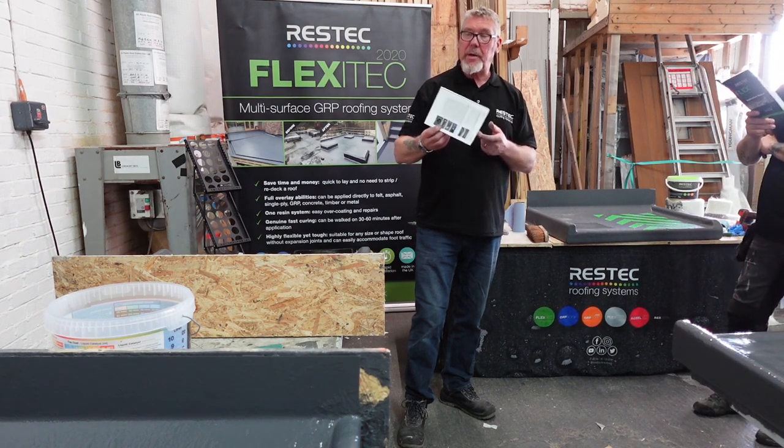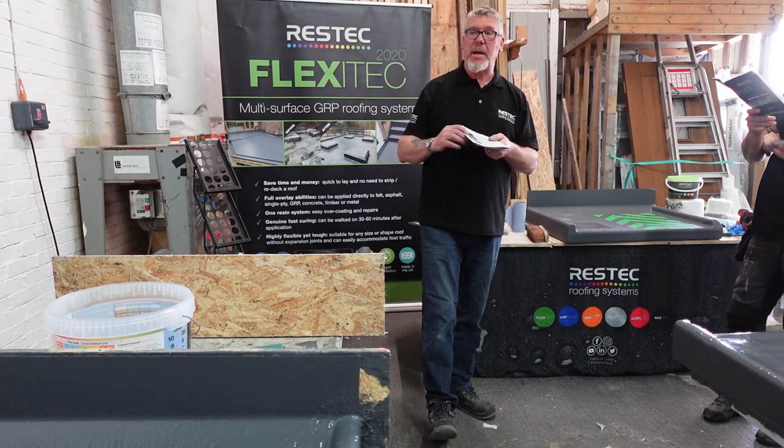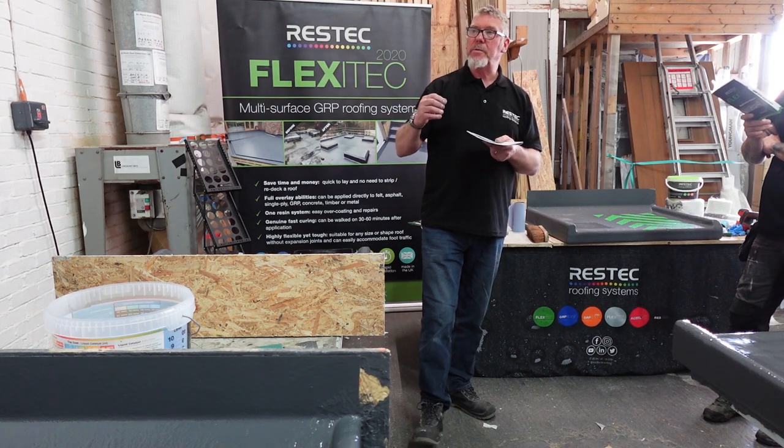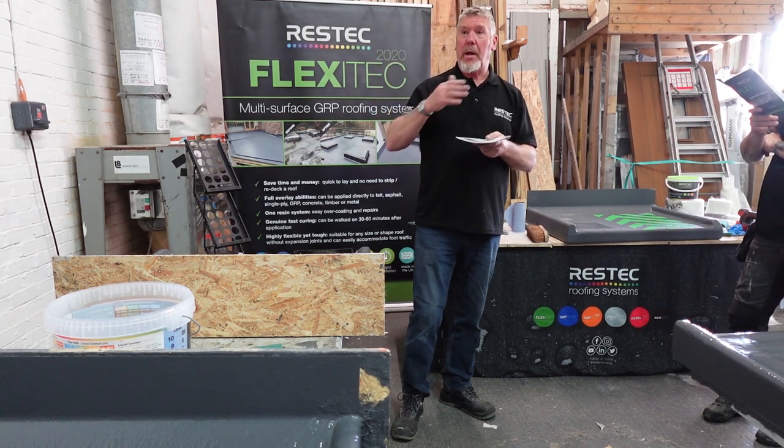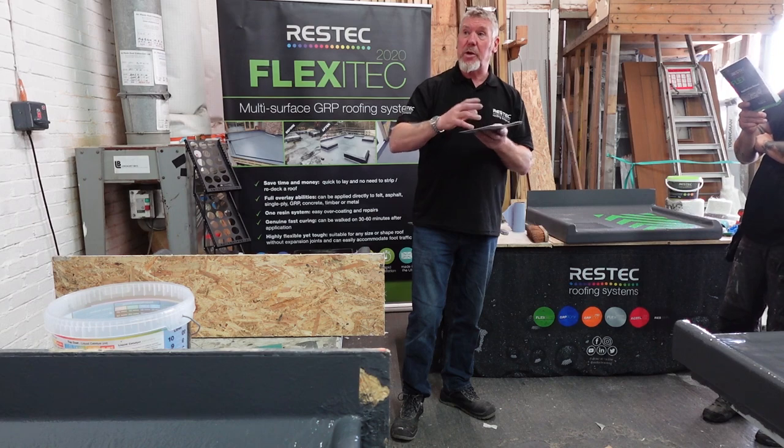If you're onto aluminium trims, you get a stucco finish with an embossed finish, or a mill finish with a brushed finish. That aluminium will have a lacquer on top of it to stop it oxidizing and turning to white rot.